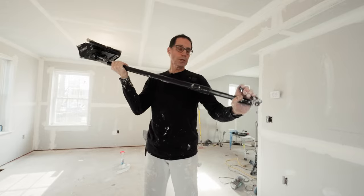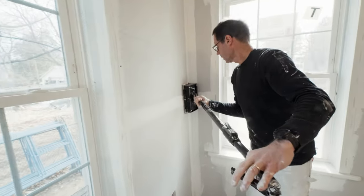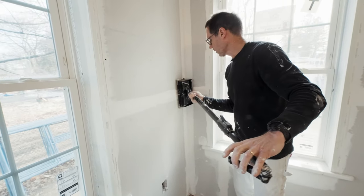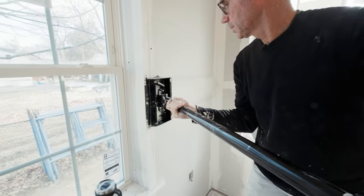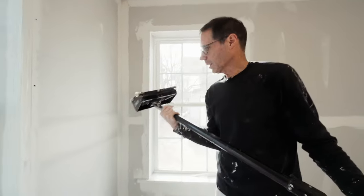As I flip it, I also want my hand on the brake. I've got the box rigid because my hand is on the brake. I press it into the corner and now as I push on this handle, it pushes the mouth of the box in and forces compound out through the head of the box — the finishing edge of the box. And that's all I'm going to do.